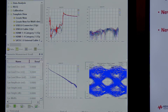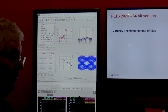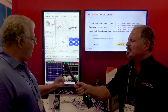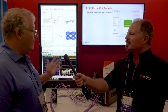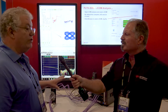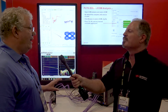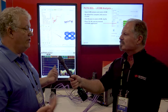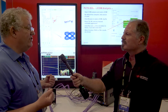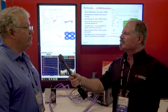Oh, that's correct. And by using these kinds of equipment, for example, this board is available for our customers. Keysight has them at some of their demos around the world, and by having 32-port VNA measurements, every board that goes to a customer for characterization has already been pre-characterized on a Keysight VNA, and we provide that information, those S parameters, in the reports. Then the customer, probably using Keysight VNAs in their lab, can replicate our results and show extremely good correlation.